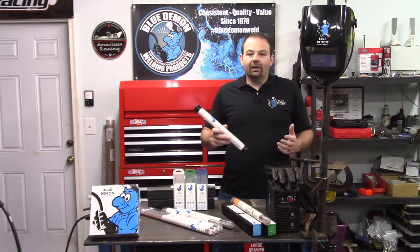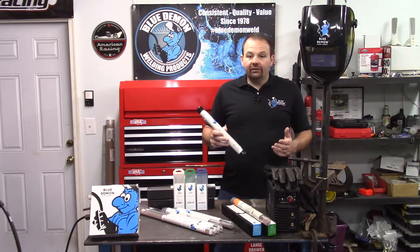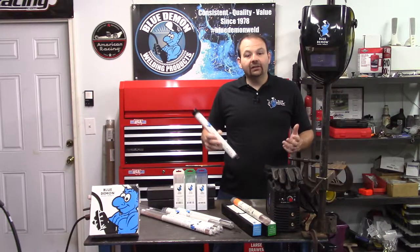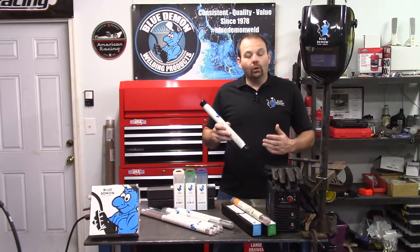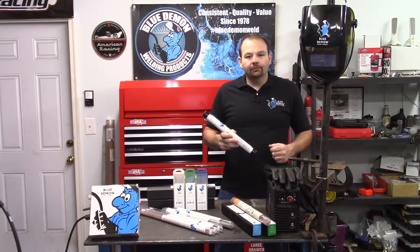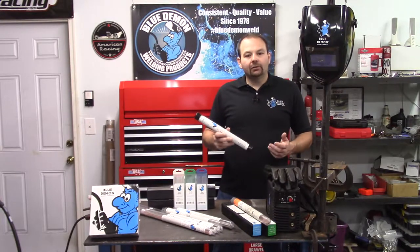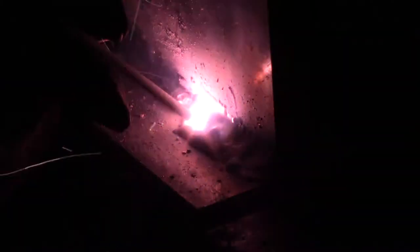One of the first questions you may have about this product: what do the letter and numbers mean? Filler metals are manufactured into different forms and classified into different categories. In our case, the classification is E, which stands for electrode. Other classifications could include ER for electrode or rod, R for rod, or B for brazing, just to name a few. Electrode simply means the filler metal carries the welding current in the process. Adversely, a rod would not carry the current and is heated by another source. An example of this would be the TIG welding process.